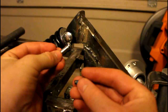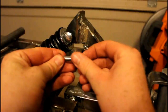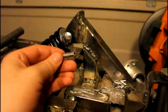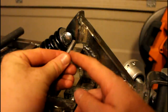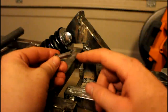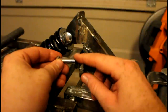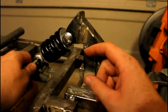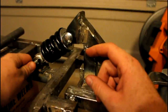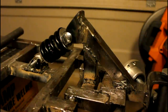The way the bolts are set up, you have this sleeve-looking bolt and then a little tiny one that goes inside and screws in. This sleeve piece isn't quite long enough to go all the way across the suspension tab, so that tiny one sticks out and part of the shock tab rests on it, causing it to jiggle around. I'm just going to get some normal bolts, nuts, and lock washers and substitute those instead. That's pretty much it with the front suspension — I did the same thing symmetrically on the other side.